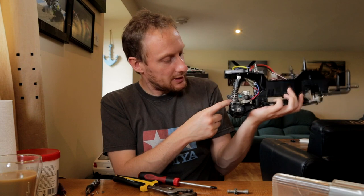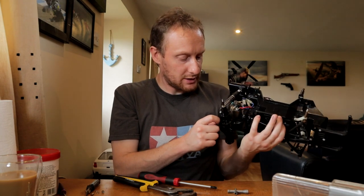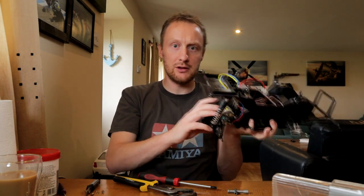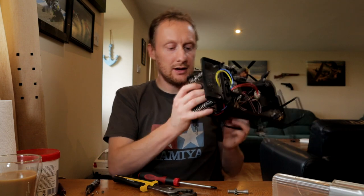There is something for there, but that one there is just a wee flap where you can oil the gearbox. But I want to take the whole thing apart and have a look inside and evaluate. Because I don't use oil in these. These are really coarse. They're massive teeth on these ones, so I wouldn't use oil. I'd use grease for that.